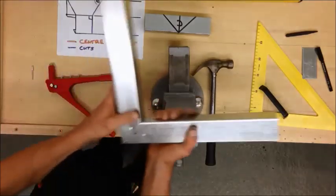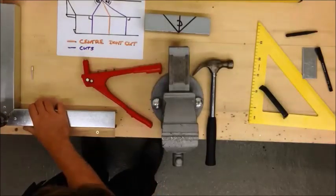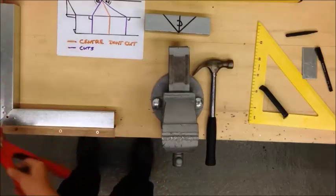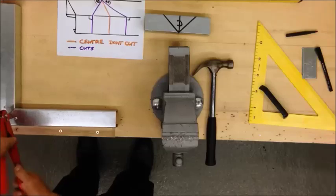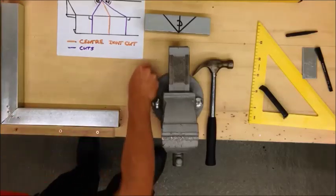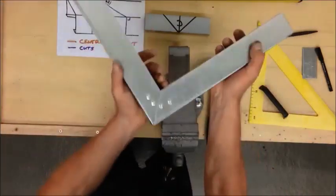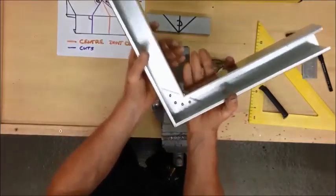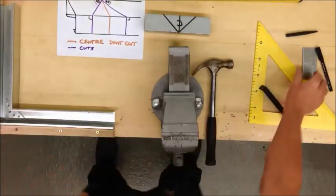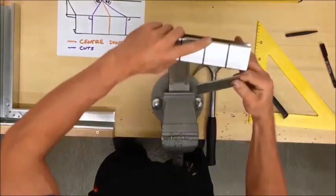Now my last one is slightly off centre. Really simple to resolve — put it back down there and in with the final rivet. There we have it. Now the bottom is nice and secure, that's strengthened that up, but we haven't secured the top. So the way we do that is with our remaining rectangular piece.